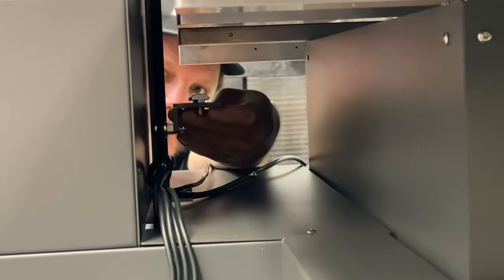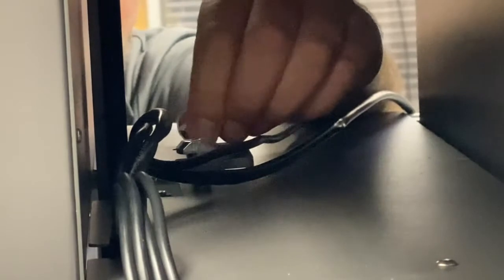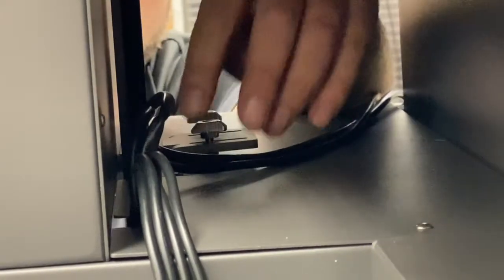It's got 2 wheels. There's 2 sets of T-nuts on here. They're going to be tightened down. The way these T-nuts work, you're going to have to loosen them almost all the way. Don't take them off, but just loosen them so you have just a couple threads on. Because these T-nuts go into the channel up here, and then you need the T-nut to spin 90 degrees and then tighten down. If they're not loose enough, it doesn't work.